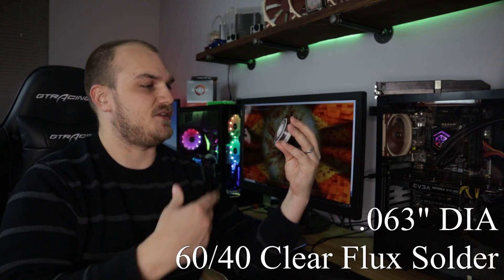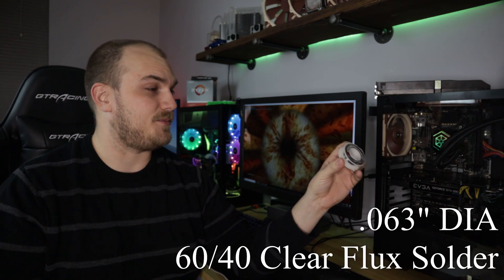70°C is actually better than what it used to be, but I previously had the card mounted vertically close to the glass, so that's pretty much all due to airflow. In a nutshell, the FPS is the same as it used to be, there were no stutters or hiccups. The RGBs don't work, but that's kind of what led me into this in the beginning. Other than that, the card seems to be operating just as good as it always has. We also proved that at least this solder does melt in the oven at the temperature I had the card at — so if the solders are similar, it should have had the opportunity to reflow. And if my short popped a connection, it could have reconnected. All I know is I put it in the oven and when it came out, it worked again.